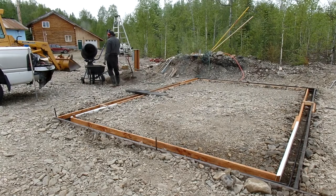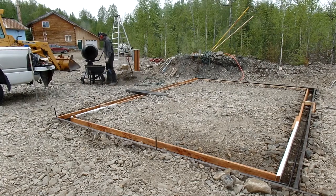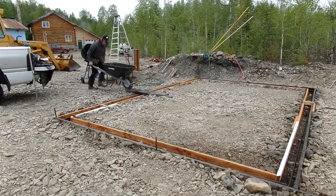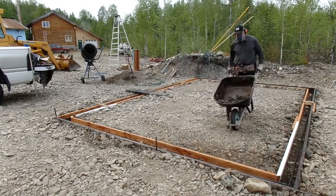The water is always very tricky, because usually there's some water built into your sand and your gravel — I wasn't totally sure how much water to use here. In this case I didn't put in very much. I always like to err on the side of less water, because concrete is much stronger the less water it has. The downside of lower water you'll see in a sec — I've got my wheelbarrow full of freshly made concrete. The forms are a lot smaller than I'm used to.